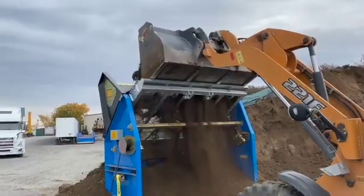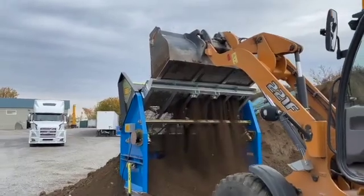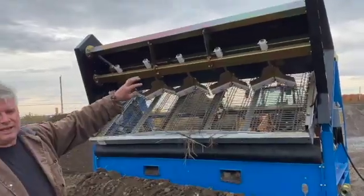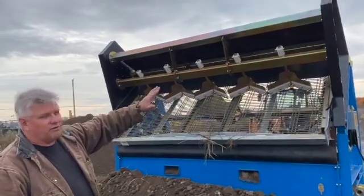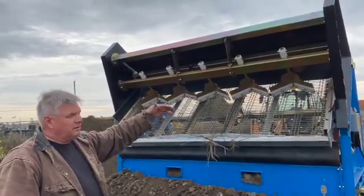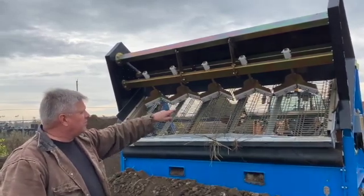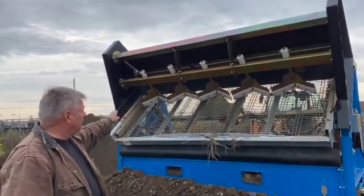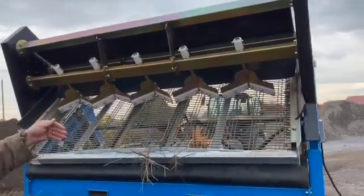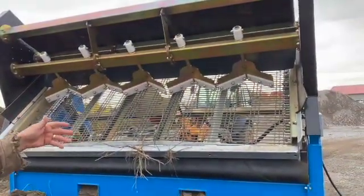You'll notice we feed it even faster than ever now with this machine. The top of the shafts here, we've designed them so they're cut on a 45 so they're self-aligning, always bringing themselves back to center. We've put UHMW skirts on the bottom so if they come in contact with the mesh they'll wear in the UHMW and not make all the noise of the steel.